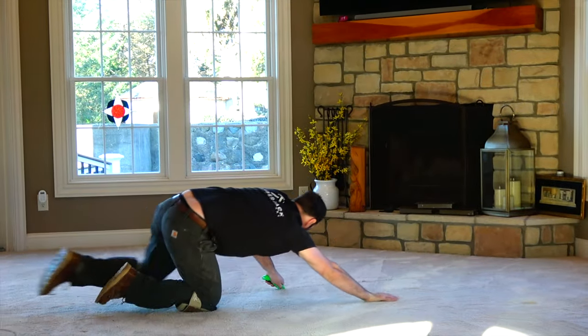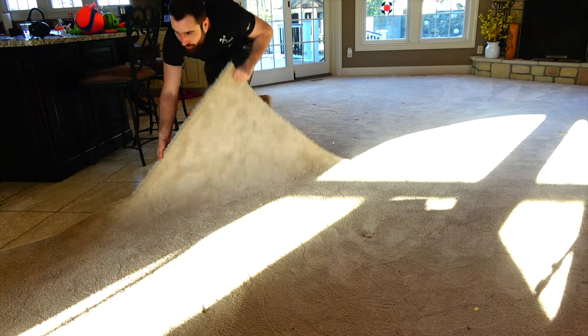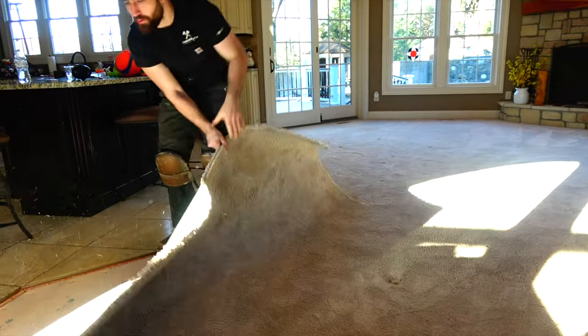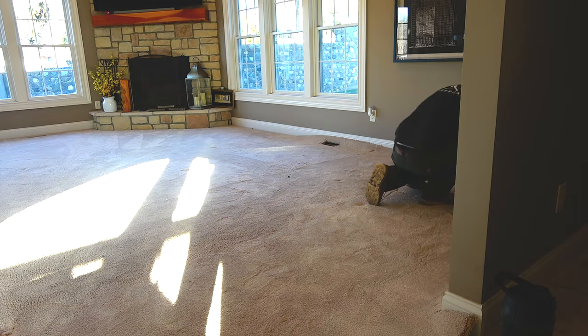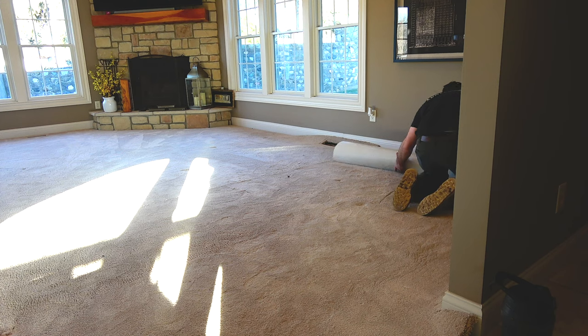In this video, I'm going to show you exactly how to rip out carpet really fast. You start by cutting it down the middle with a utility knife. This is a little hard to do — you have to really press through and get the fibers on the back. But if you press hard, it will work.